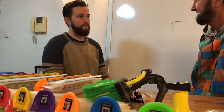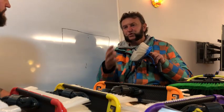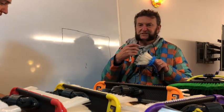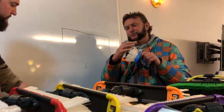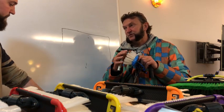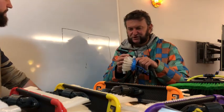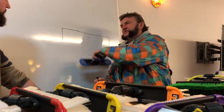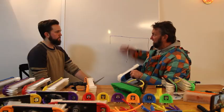Yeah. What cleans the glass? The bristle tips. On a nylon brush, the bristle tips. On a boar's hair brush, the tips of the bristles and the sides of the bristles both. What happens with boar's hair? It soaks up 30% of its weight back in water, and then it becomes soft, because anything which soaks up water becomes soft. And as it becomes soft, it drags on the glass, and because it drags on the glass, it has more agitation.